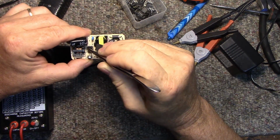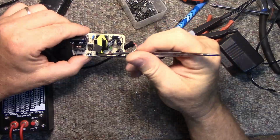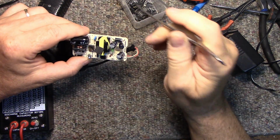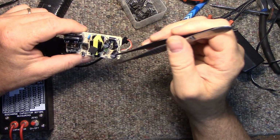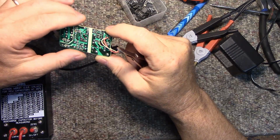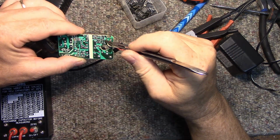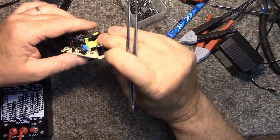These chips, they have the controller circuitry and the MOSFET all built into one little package, and that's what they use for driving the switch mode power supply. And this is pulse width modulation, and they just put the bare minimum in these things for the output. They got a diode, a choke, a couple capacitors, and then they got a little feedback circuit. I don't even think they have a TL431. There's nothing on here. You see, they get populated for Zener diodes and stuff, and it's all empty. There's only a resistor, and all these others are empty.